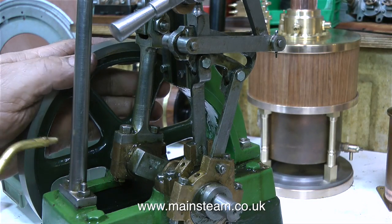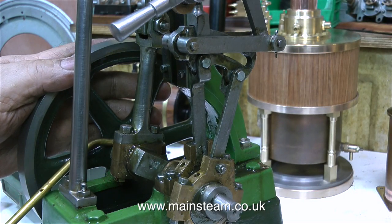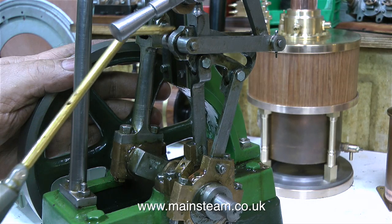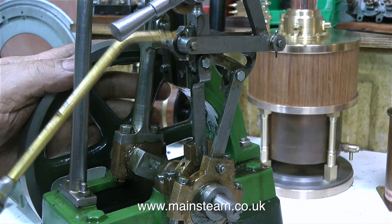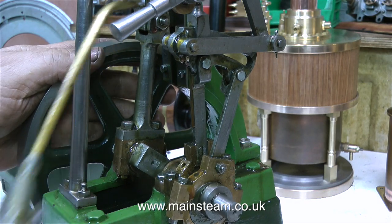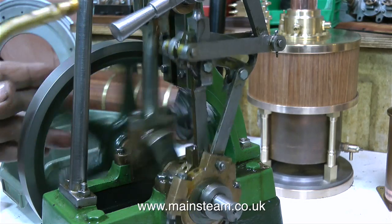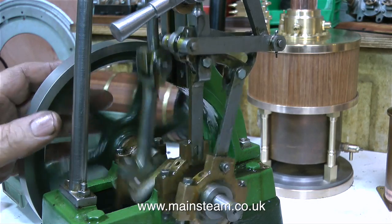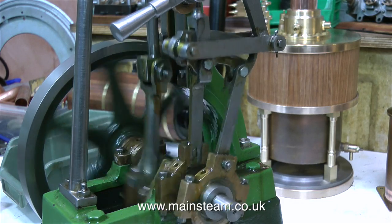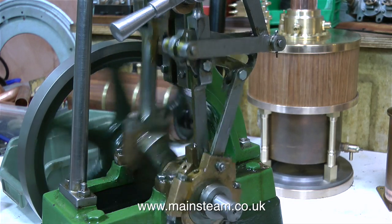It's been running for a while — I think it's time for some more oil. Steam engines use a total loss oil system, so periodically stop your engine and just give it a bit of oil. This is my usual oil mixture of steam oil, rapeseed oil, and some machine oil. I'll stop talking for a short while so you can have a listen to the evenness of the beats and watch the wheel go round.